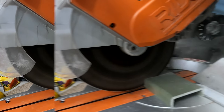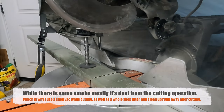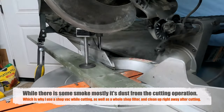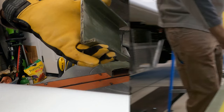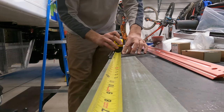As you can hear from the motor bogging down with the cutoff wheel and the smoke, the cutoff wheel does burn the fiberglass a little and bogs down somewhat. A laminate blade or aluminum blade actually cuts this FRP better, so I went ahead and switched over to that later on in the cuts — just a tip that works really well.